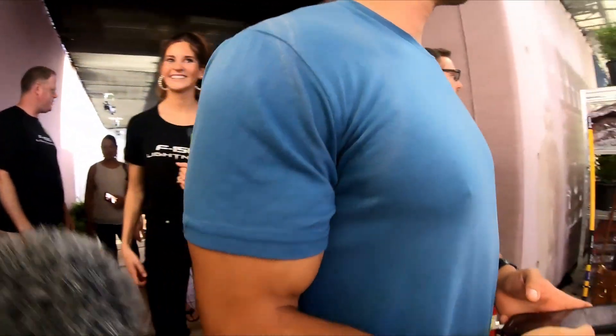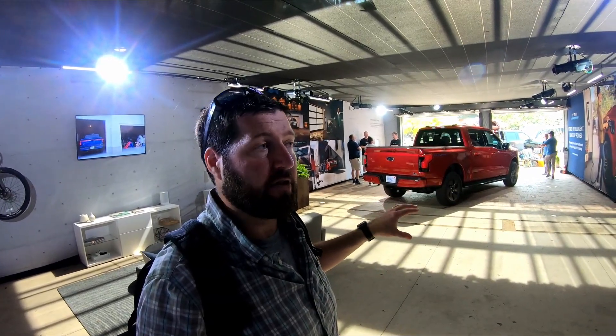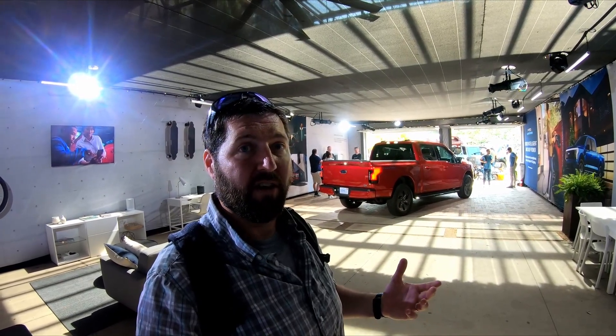Awesome, thank you so much, really appreciate it. I'm glad you guys came — I know that was kind of a long video, I really hope that helped. I have been learning a ton about this truck. It's just so funny that we have an electric truck now; I keep saying electric car still. I cannot wait to get this hooked up in my house. What he didn't cover is that the inverter over there is actually also a solar inverter, so you can use it to power your house from the truck, but you can also have four parallel strings of solar panels to the same unit. You don't have to have a whole separate solar inverter or solar system. The Sunrun unit actually includes solar input as well. I hope you guys liked that video — feel free to like, share, subscribe. Thanks a lot, guys.